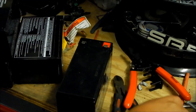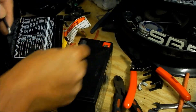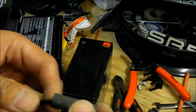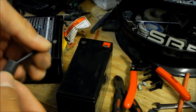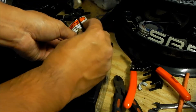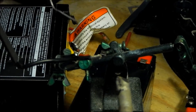This is the black one — I'm gonna use some black shrink tubing. It should be big enough to fit over the terminal like that, and it'll shrink a little bit. It doesn't really have to fit the wire too well; you're just trying to keep stuff from touching. It also helps with corrosion. Go ahead and tin the end of the wire with your soldering iron.